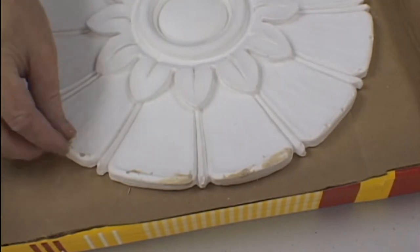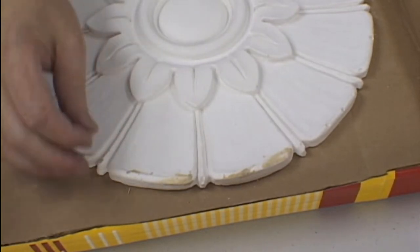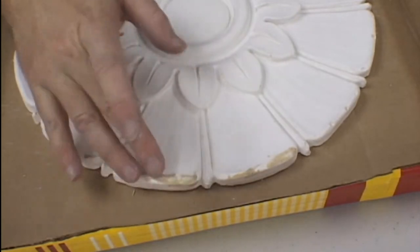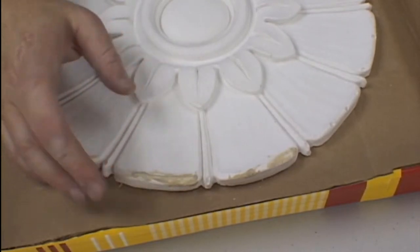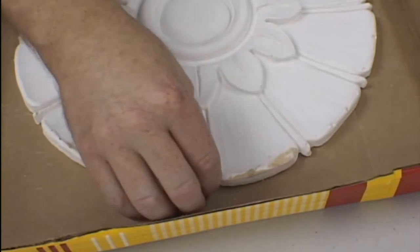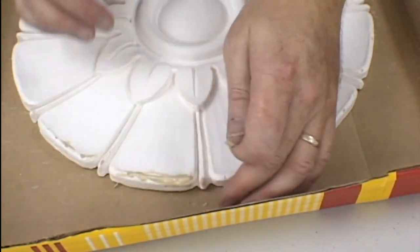Use an oil-based clay on your model for patching. It will not interact with the latex and it will not dry out on you during the molding process. Go over your model carefully and make sure you fill all defects. Take the time to do a good job here and it will reward you with beautiful castings as an outcome.